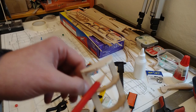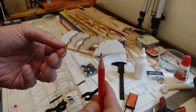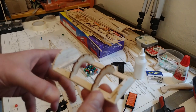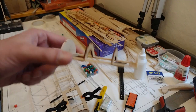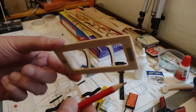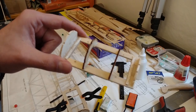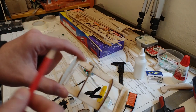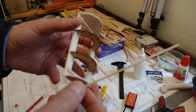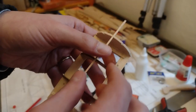For the hatch formers, the middle ones — numbers three and four — I could reuse. Number three I had to cut off because the original was completely round. I had to remake formers two and five, shortening them by the width of the two side plates — I think two millimeters each, four millimeters total. I've also put in some holes with toothpicks to act as dowels to make sure it doesn't move, though the magnets may be strong enough on their own.